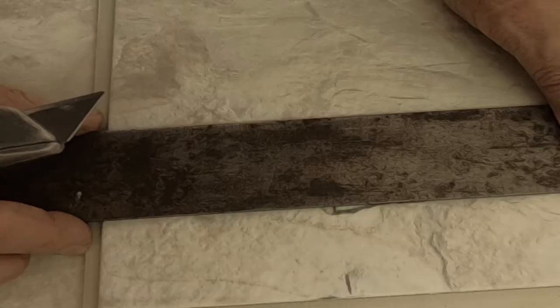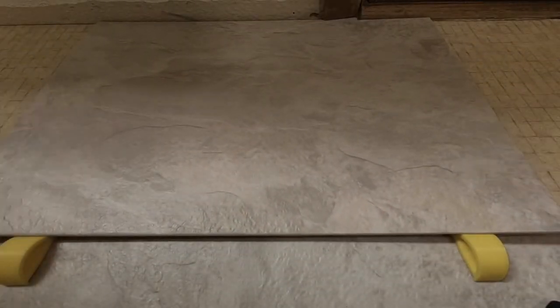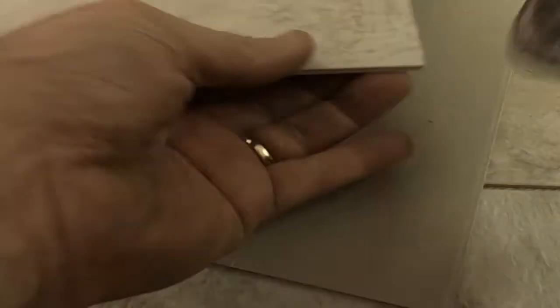First I want to transfer my stop line to my other marks and freehand my curve. For this one tile I have two different straight cuts, a freehand cut, and a snipped cross cut. With the freehand cut I allow my knife to continue into the waste area so when I break off the long scrap I have a good starting point. Looks like I'm about three millimeters too long — I guess I forgot to give Archie his space. I'll re-trim it with the snips and slide it back under the casing.